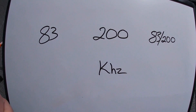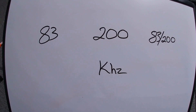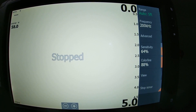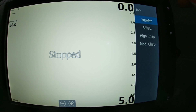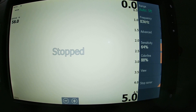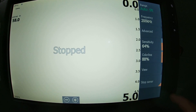Once we do that, we're going to hop over to the Humminbird Helix and do the same thing there, and then we're going to get into specifics on when, where, and why for each of these different frequencies. On my Lowrance, from the home screen we go to the sonar tab — you would start seeing your sonar recordings right here. On the right-hand side in the drop-down menu there's a frequency tab. On this unit I've got 200 kilohertz, 83, high chirp, and medium chirp options. You just tap whichever one you want — tap 83 and you're displaying on 83 kilohertz; tap 200 and you're on your 200 kilohertz beam.